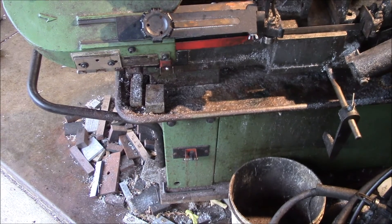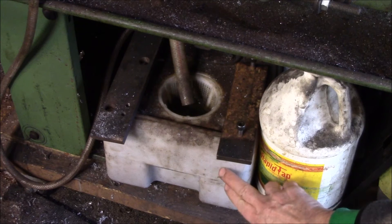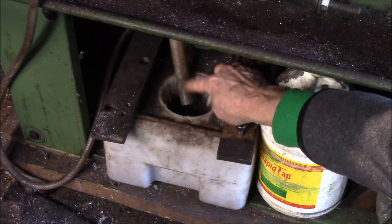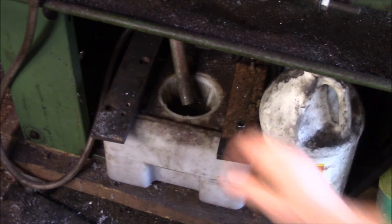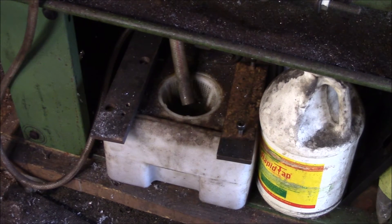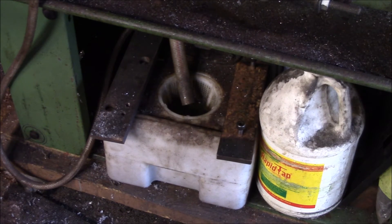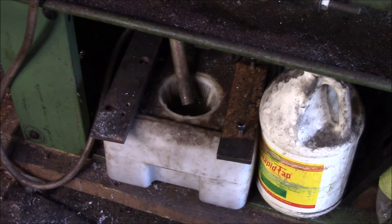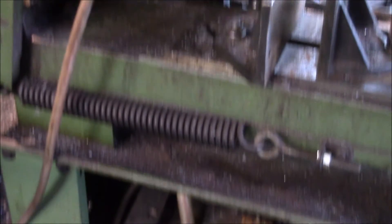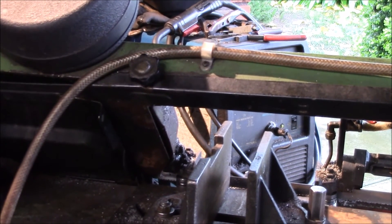On the other side is the coolant pump. It's got a two-gallon tank, and then there's a tube that comes down from a hole in the bottom of the catch pan to recycle the coolant back into the tank. There's a little strainer — you can see that plastic cup — and farther inside is the recirculating pump. It feeds coolant up this hose, along and over to the other side.